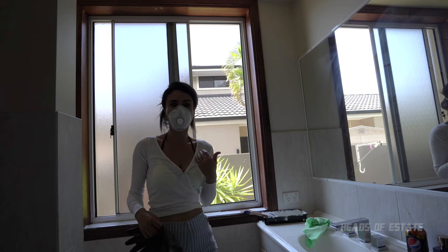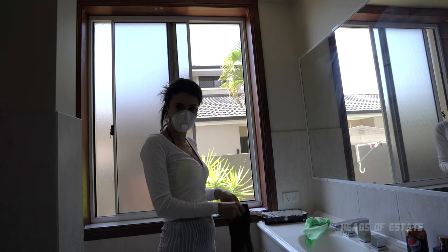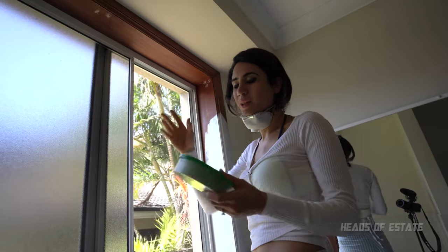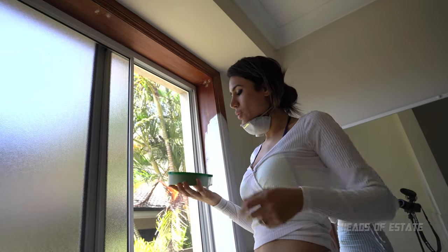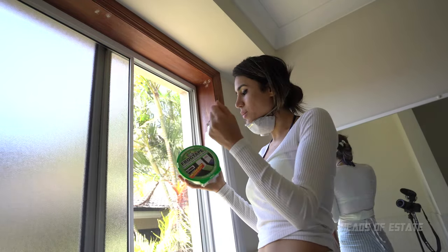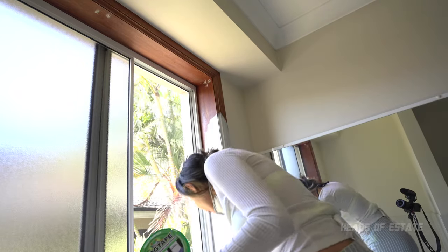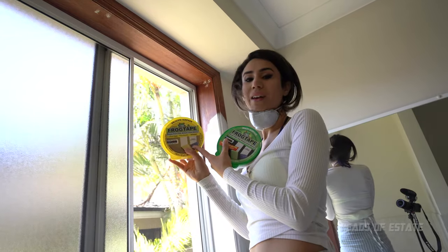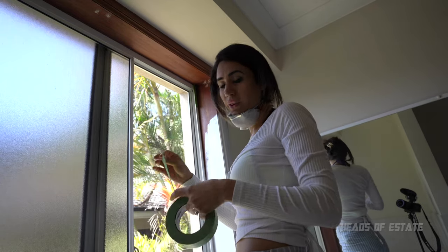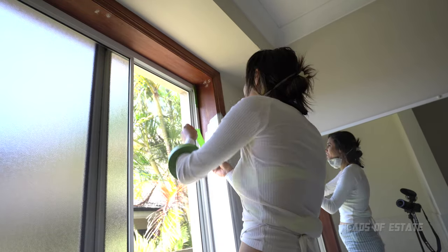Obviously, I'm not a painter — you're probably telling me in the comments section I'm doing it wrong, but I'm trying. This is trial and error. For these tricky-to-reach areas, where you're worried you might end up painting your frames or windows, I've opted to use some frog tape, which is painter's tape. Frog tape comes in two types: green and yellow. Yellow is for delicate areas — for example, if painting around windows and you don't want to get on the glass — and green is for other surface areas. The great thing about this is it is green, so I can see it on a white background.